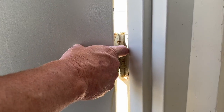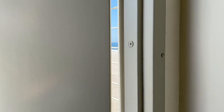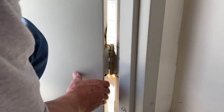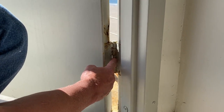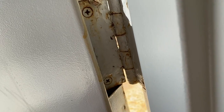The lower hinge — as you can see through the door, beautiful Pacific Ocean. This is oceanfront property on the rooftop, so we have a lot of rust. That hinge has rusted shut and seized, so the hinge won't move, and people have been slamming the door which has destroyed the metal in there. Once that happens, there's no way to fix it — it has to be replaced.